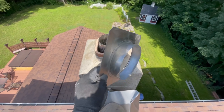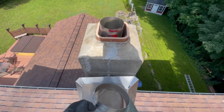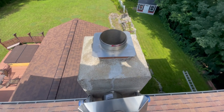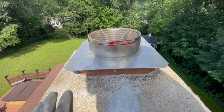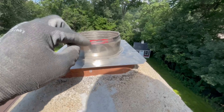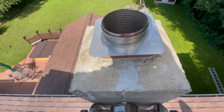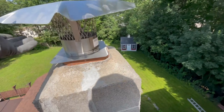I want you guys to take a look at this top plate. I've been complaining about top plates to New England Chimney and National Chimney for a while, and finally I called Jeff Garvey over at National Chimney. Jeff is awesome when it comes to custom product — I just call him up and tell him what I need. Look how tight and low-profile this is: the flue doesn't stick way up out of place, just a little bit, and it's super tight — I can barely fit my finger between the liner and the top plate. I can just put silicone down to the flue, put my three stainless screws in, and then the rain cap goes right over the top and clamps on normally.